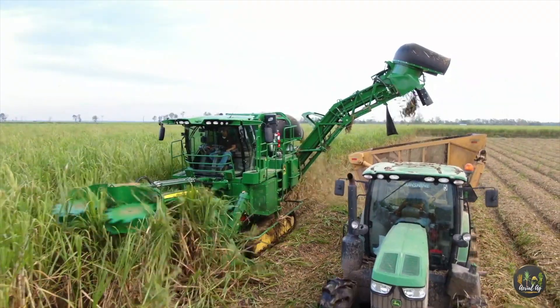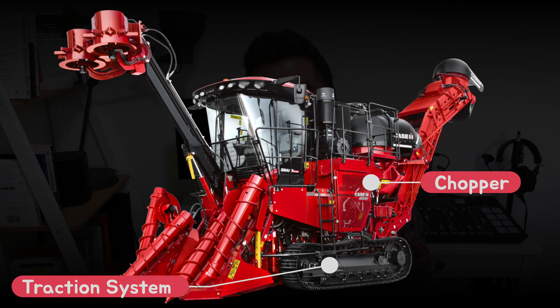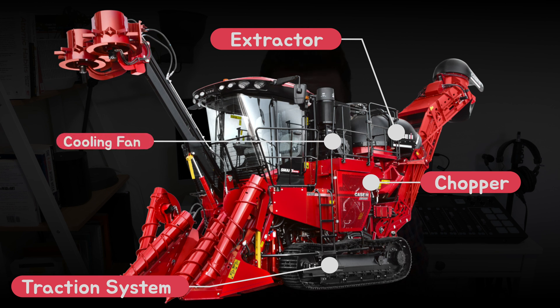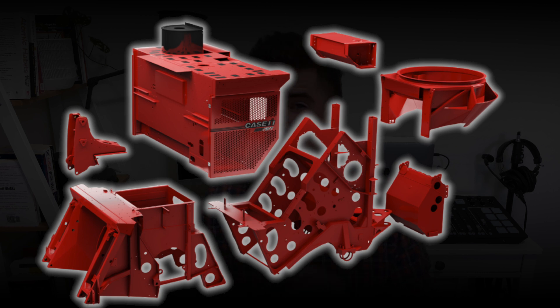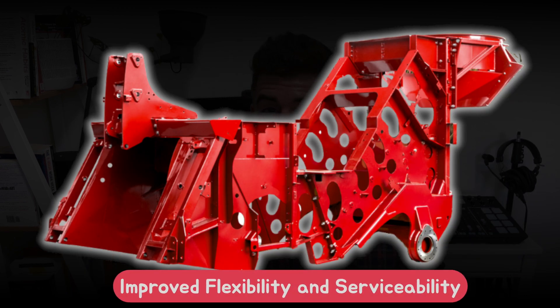It's no secret that hydraulics is where John Deere's flagship CH570 harvester had the edge over the previous A8000 series. But Case IH have made some pretty huge changes to the hydraulic system — like completely different. The most considerable being the old gear pumps being replaced with new variable displacement piston pumps for the majority of harvest functions. The piston pumps allow for higher operating pressures as well as a significant improvement in hydraulic efficiency, which inevitably leads to a lower total cost of ownership in terms of parts and fuel, as well as allowing some of those new automation features. Case IH have also changed to a bolting type hydraulic tank to match their new modular system on the new A9000 series chassis, greatly improving its flexibility as well as serviceability.